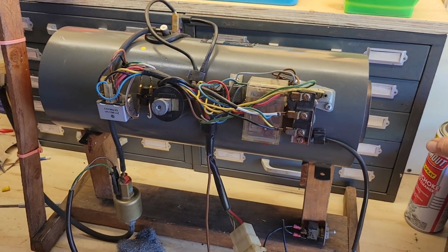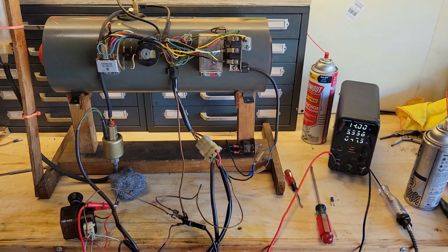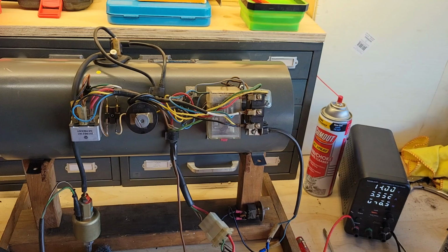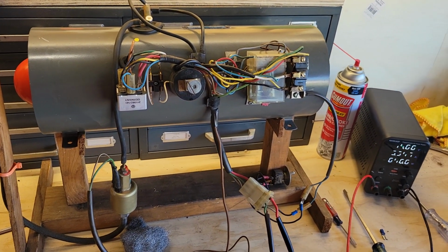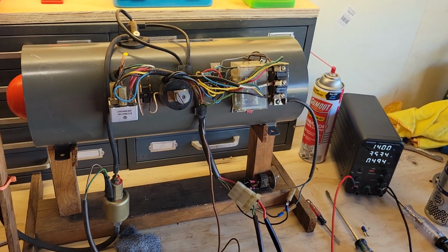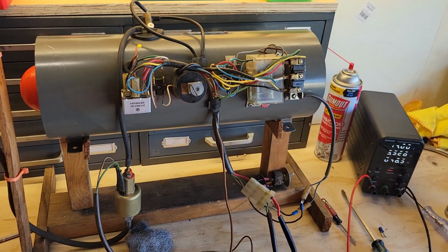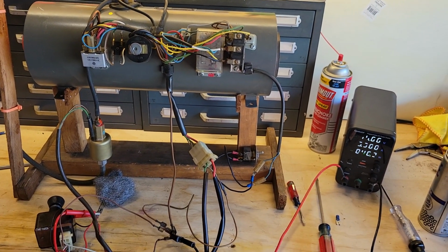With the thermostat on, it'll run for 45 to 60 seconds, maybe a little over 60 seconds, typically, before it goes into a shutdown mode to where it cools off. And that's controlled by the thermostat. Once the thermostat thinks it's reached the heat temperature it needs to, then the thermostat will kick it off, which is what this switch does right here. And then it'll go down to a cooling mode. And I'll show you what the thermostat does with that switch down there.